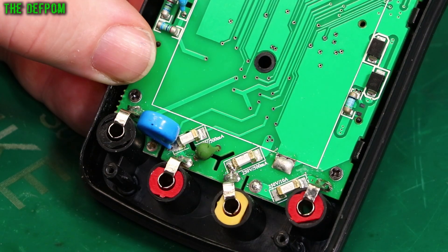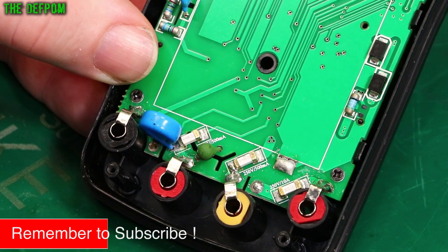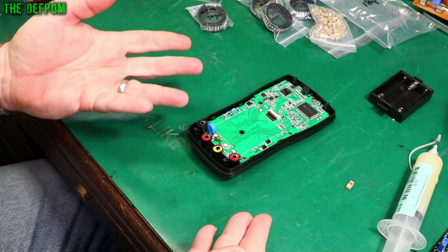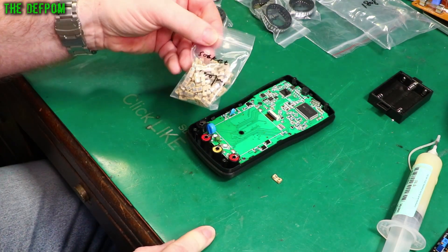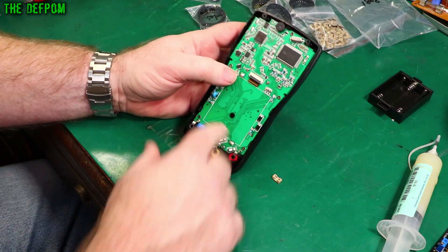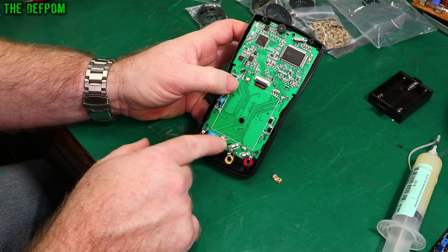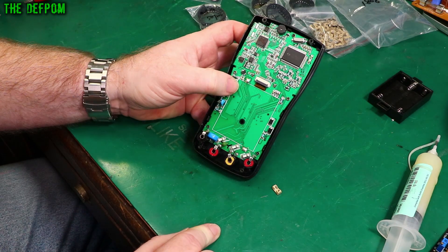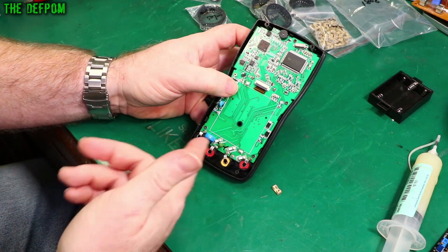The meter didn't come with any spare fuses, so it relies on someone who actually does electronics to be able to source the fuses and install them. Not ideal. I'm modifying it slightly — I purchased some fuse holders. I'm only going to put in one. I'm going to take this board out; I don't want to risk melting the plastic. I'm going to take the fuse out — that's the one that's blown — put a fuse holder in its place, and now I can pop a new fuse in. So let's do it.